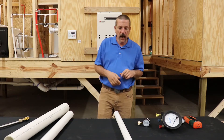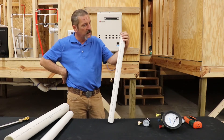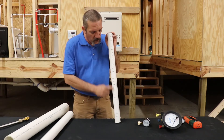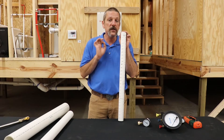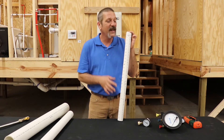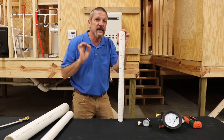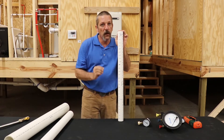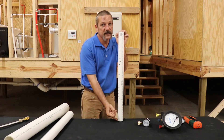So how do we measure that? I've got a piece of inch-and-a-half PVC DWV here. I took out my tape measure and made some graduations — some little inch marks going up and down — and I cut this pipe at 28 inches. The reason for that: every 28 inches of water column is going to generate one PSI at the base of it. It's really like 27 and five-eighths, something like that, but let's keep it simple. Every 28 inches generates one PSI at the base.